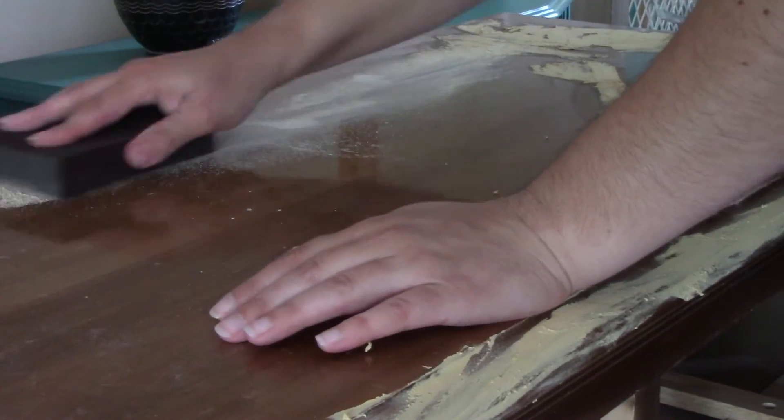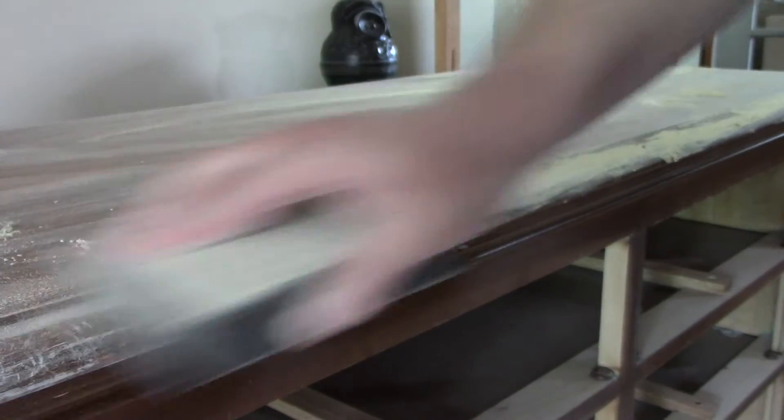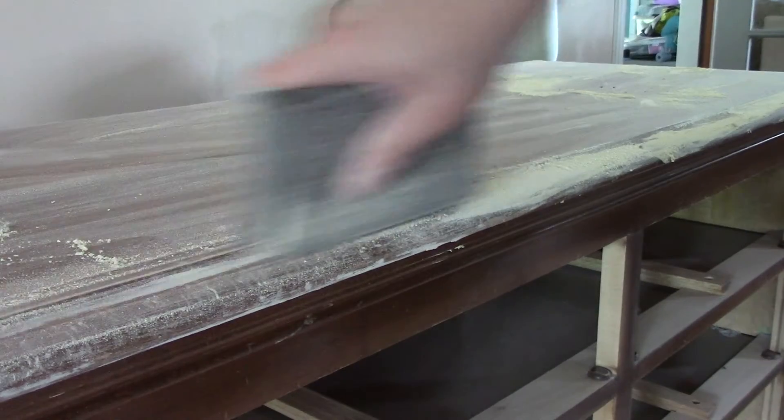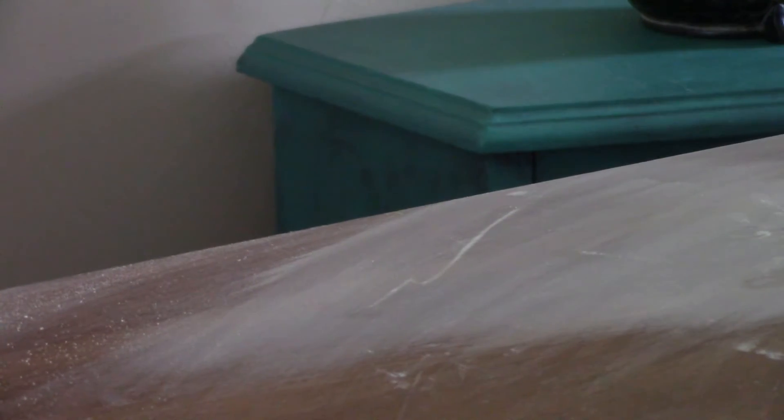Then you let it dry and sand it. I like to use a sanding sponge — I went in first with one that was pretty rough, then a medium grit to smooth it down. I started this outside, but we are in crazy gnat season here so I was getting eaten up, so I don't have video of me applying it. I definitely applied it thicker than I should have because I was just trying to get it done and get out of the bugs. But in the end, I did a lot of sanding and got it nice and smooth. With chalk paint, one of the benefits is you're not supposed to have to sand ahead of time, but I did rough up the rest of the top as well, because I'd filled in so much that I wanted to make sure it would take the paint in the same manner.